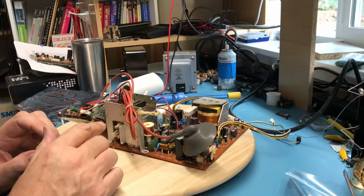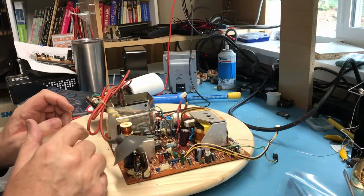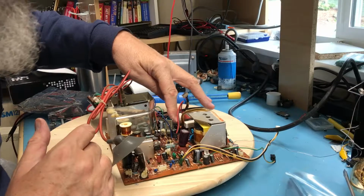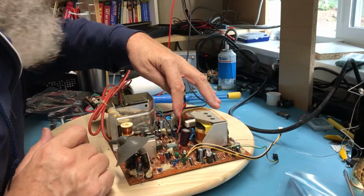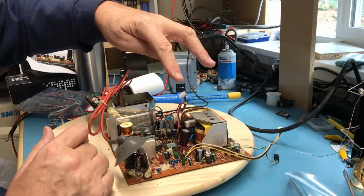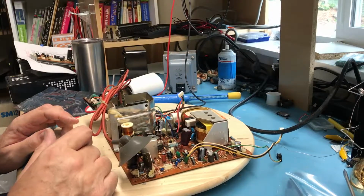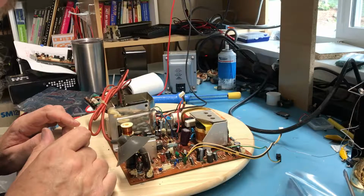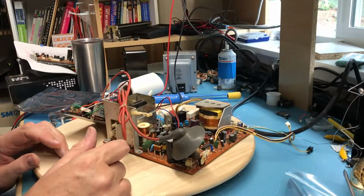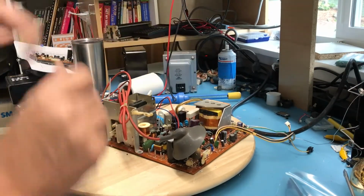You know, if the high voltage isn't running, and there is that feedback directly from the high voltage to this essentially transformer sitting here, it's T501, we looked at it before, that may be what's providing feedback to the power supply that closes the power good loop. Although who knows, anything's possible, but that might actually explain the core issue here. Who knows? So I'm going to have to dig and see if I have a suitable replacement.